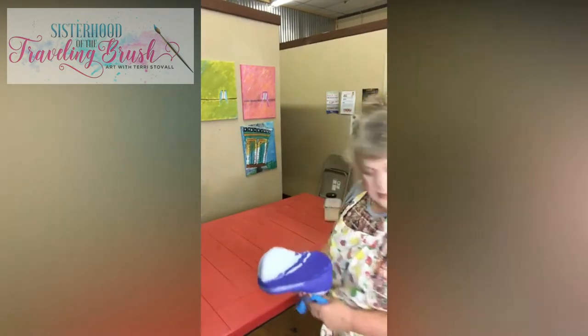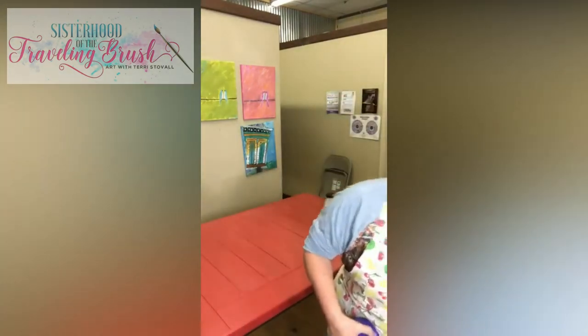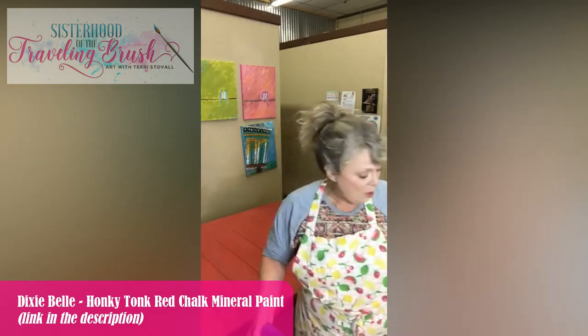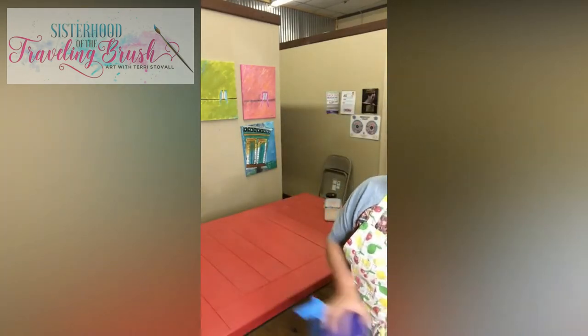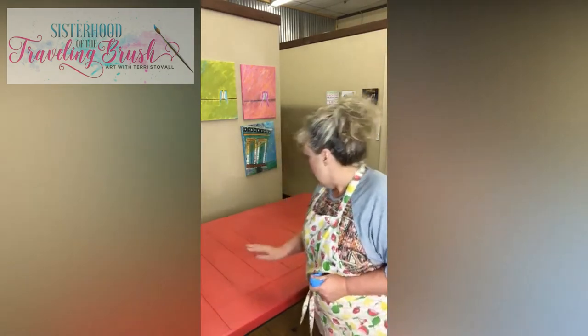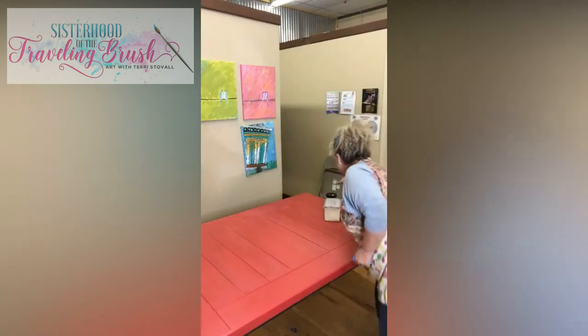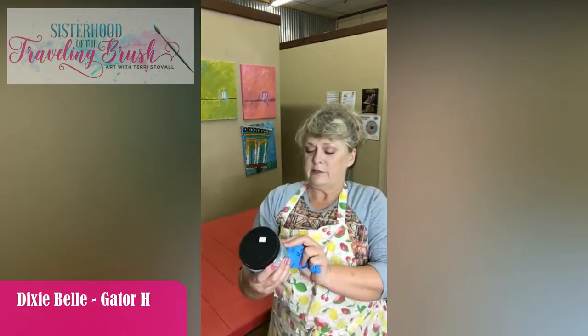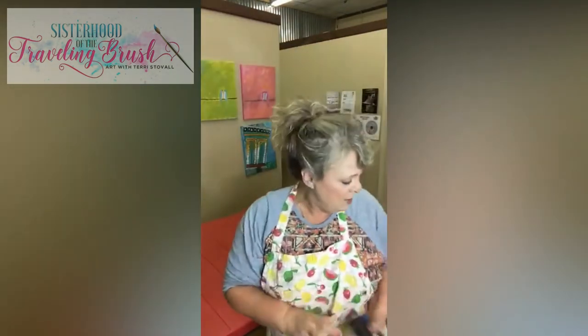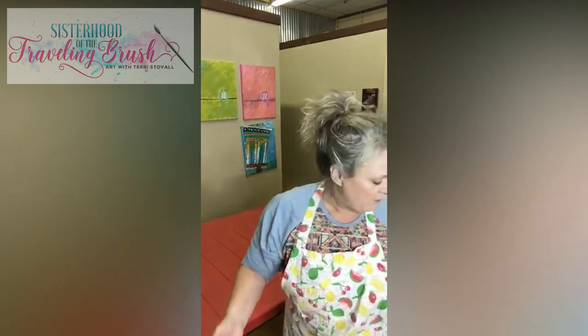The top is painted in Dixie Belle Honky Tonk Red, which doesn't need a top coat. I could leave it alone, but because this is a tabletop, it's going to get a lot of use, and putting about three coats of a good top coat on is important. I've chosen to use Dixie Belle Gator Hide because it's the strongest of the top coats I know of with the water-based ones, without having to use an oil-based product which could yellow it.